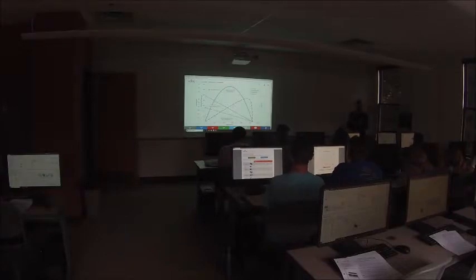But anyways, if I take a thin piece of wire and hook it up to two ends of the battery, the wire gets pretty hot pretty quick. That's because the wire has some resistivity. There's a lot of current going through it because nothing is stopping the current from going through a straight piece of wire. So when a motor's sitting still and there's no back EMF preventing current from going through the system, it's a coil of wire, but that doesn't change the scene a whole lot. It delays the effects a little bit because of inductance, but don't worry about that.